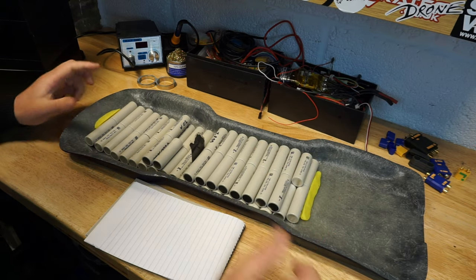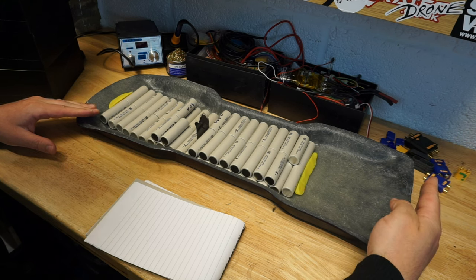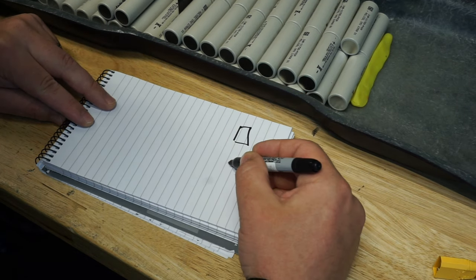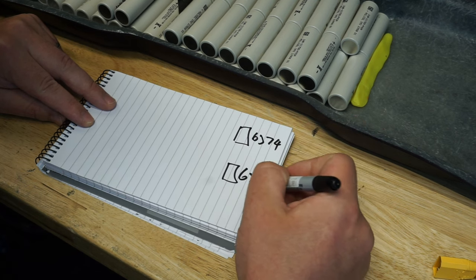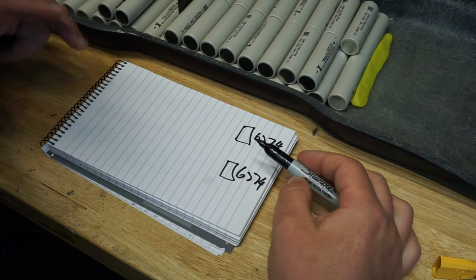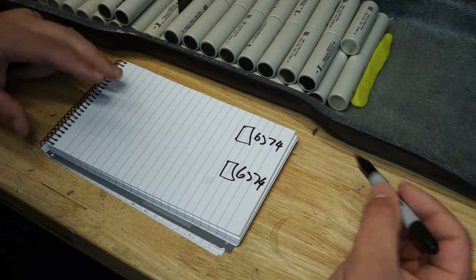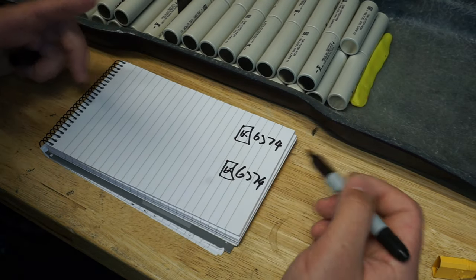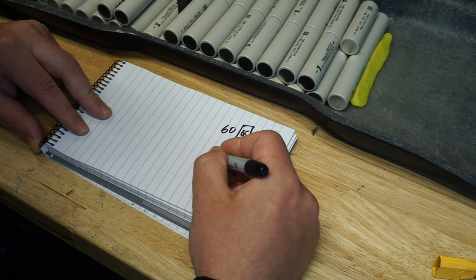Then you will end up with the space for your battery, which you should consider. Okay, then you have to start thinking backwards from your motors. Let me draw it up for you. So you've got two motors. For instance, you went for 6374 motors. If you're interested in motors, I've got a video on my channel about motors, so you can take a look. Each motor will have its own maximum amperage that it can run at safely. The manufacturer will tell you. So for instance, each motor can maximum run at 65 amp. Never run them at 100%, I wouldn't recommend that. So let's say 10% off. Let's say you decide that you will run them at 60 amp each motor.